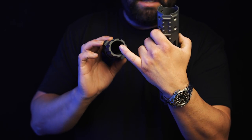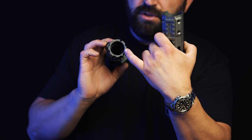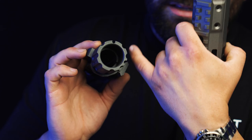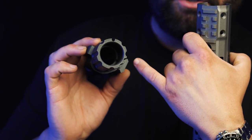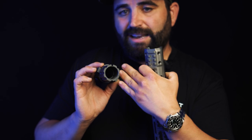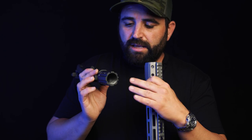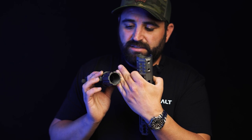You can take this off — you can see there are threads that go all the way down, and if you look inside, there's a precision milled flat surface that the barrel will sit on. That surface allows us to not need to lap that mating surface to get accuracy. We don't have any thread engagement, we don't run the risk of thread run-out, so the barrel is able to go in and sit flush.